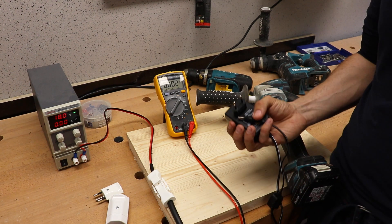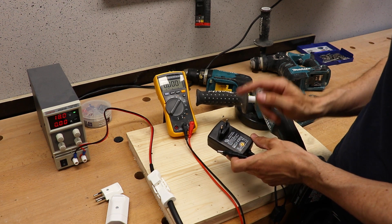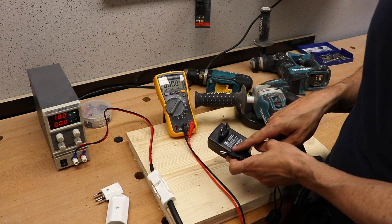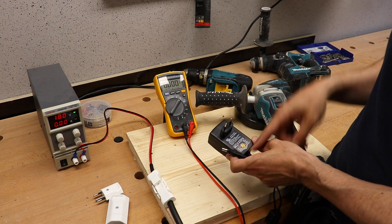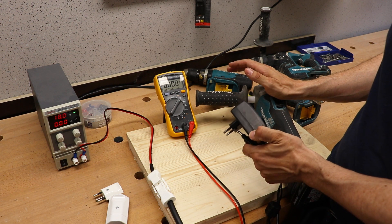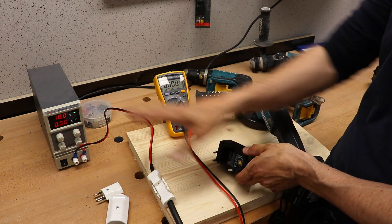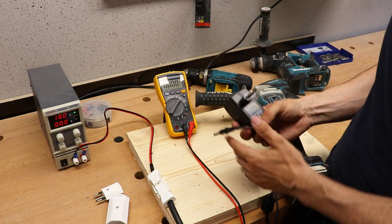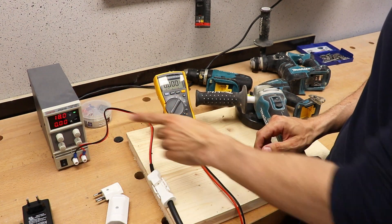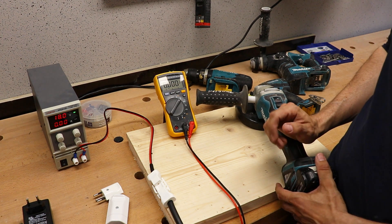There is one more thing I would like to let you know. I thought I was clever, but it wasn't that clever. I bought this Amazon plug where you can change the output voltage, but this little thing at 18V only delivers 1.2 Amperes — which is not enough. Drills need around 1.6 Amps, and the angle grinder needs 5.5 Amps. So this thing is much too weak. If you ever want to do this at home, I recommend getting one of these AC-to-DC converters — you're much more flexible, you can change voltages and fine-tune the amperage. Alright, that was it. Thanks for watching and see you next episode.